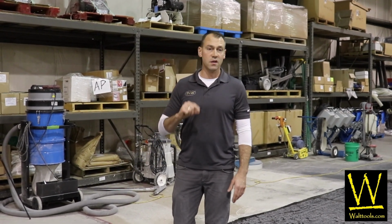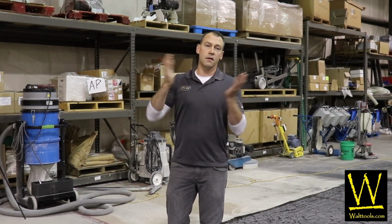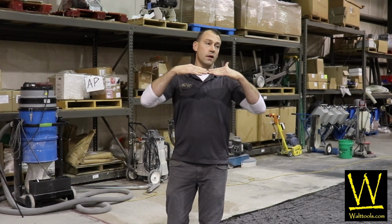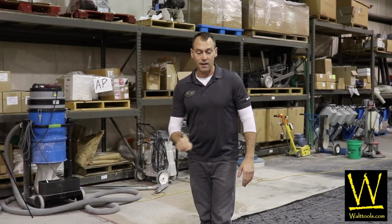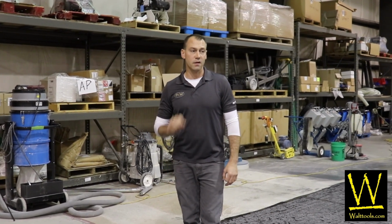Because again, if we're a little too thick, we broadcast that flake in, it's going to sink. Like Don said, the resin's going to go over the top of the flake, and then the quartz is going to stick to that, and we won't see the flake. That's probably the biggest screw up there is. And then also knowing that that layer's so thin, it's not going to mask very much of what's behind it. It's acting basically as a very thin layer of glue.